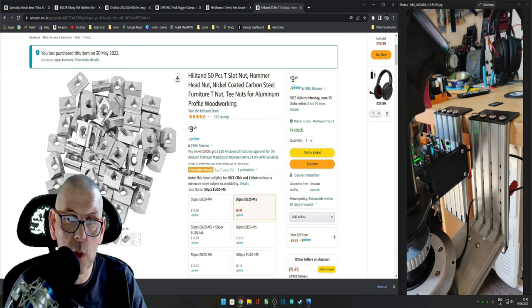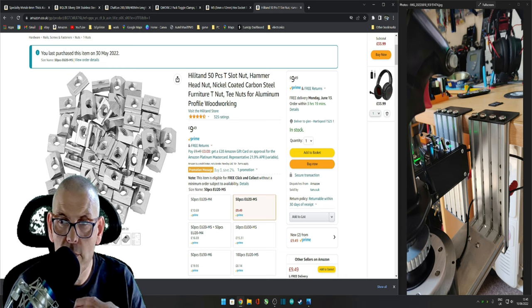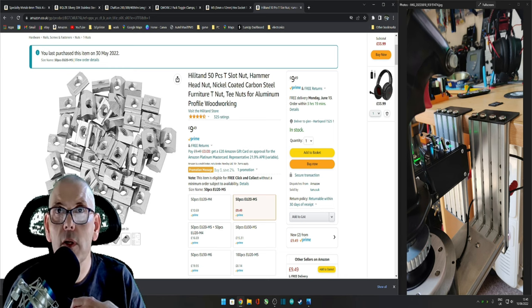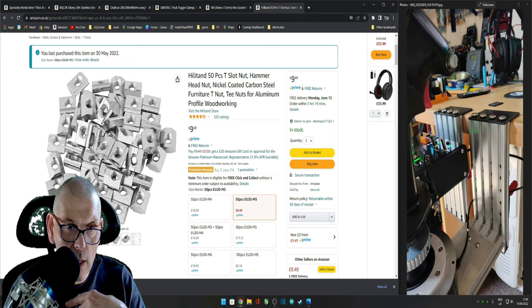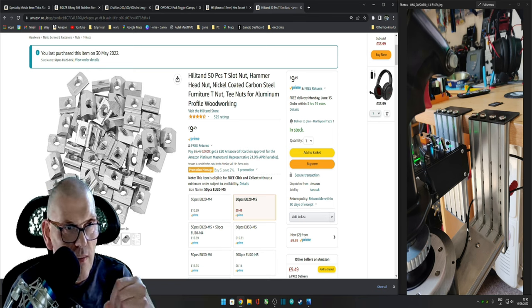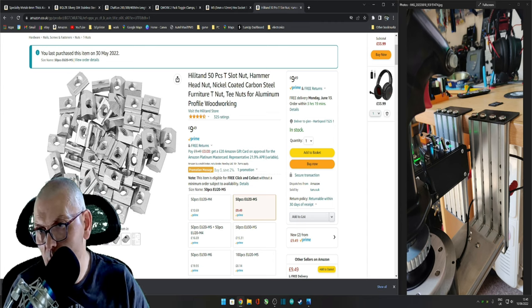So if you want that option, you don't do it the way I've done it. I've bolted all the way through. So from here, there's bolts that run all the way through, about 50 millimeters in depth, all tapped out. So there's four of them, because I wanted a really strong bracket. I didn't want it to be flexing and then snap.